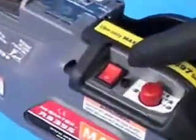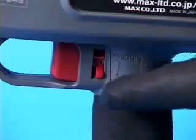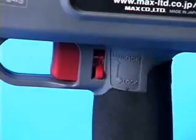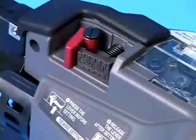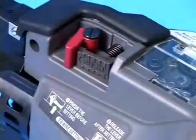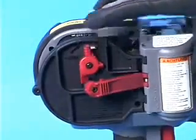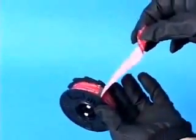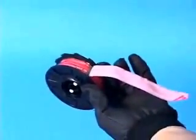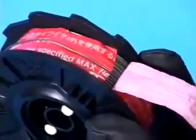Confirm that the main switch is turned off and trigger is locked. Then, press the release lever. Also, confirm that the release lever is caught in the red release stopper. Push the reel stopper to release the reel holder. Peel off the adhesive tape holding the tie wire about halfway, like this. Do not peel it entirely from the wire spool to avoid tangling the wire.